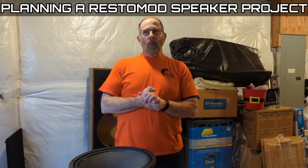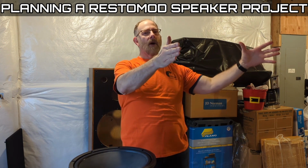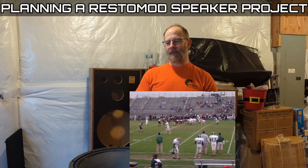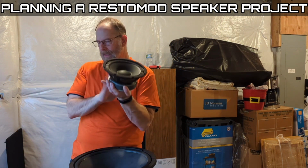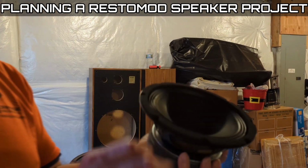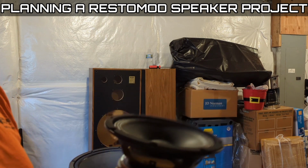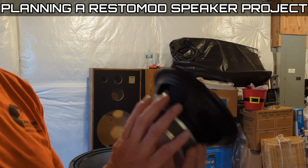So when I think about PA speakers, especially the older ones, they're designed to project sound far. I used to coach youth football, and yeah, if you want to go across the football field, you want PA speakers. So what's the difference? A PA speaker, by contrast, has a much bigger magnet and much greater power handling. And this is a cheap one. This is maybe a $30 pro woofer from Dayton. It's a mid-bass driver, and I think this thing handles like 200 watts RMS.